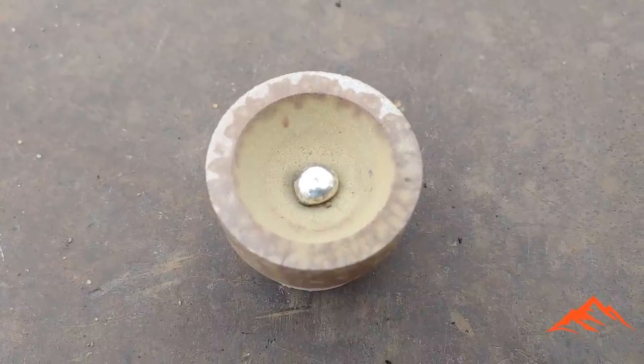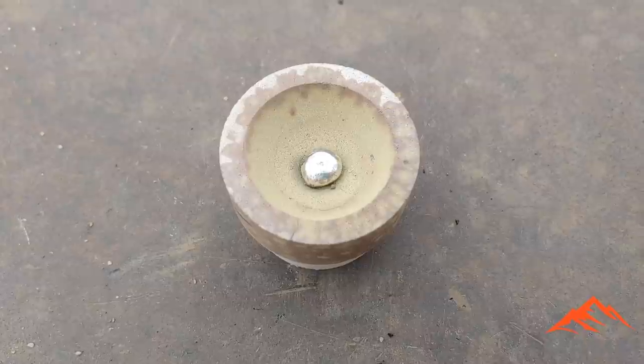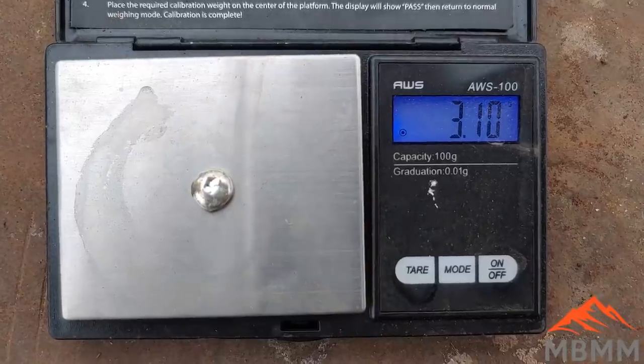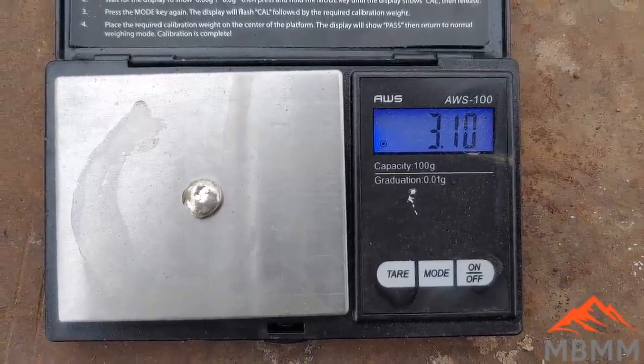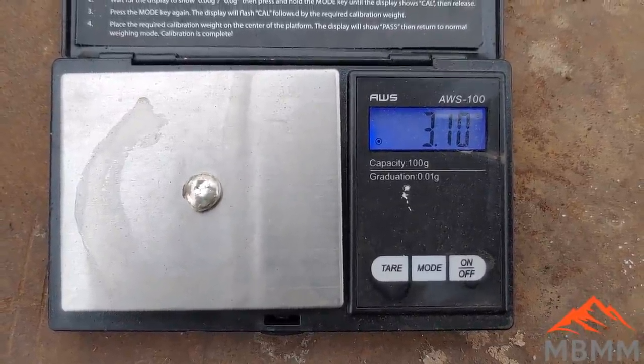And there's a little bead. We got it pulled out of the furnace. It's mostly silver now, so it's probably over half silver by weight. But we'll get it pulled out of there and get it weighed. And there we go. We got a little over 3 grams. So I wanted to show you guys that's a real good way to take a bunch of little beads and stuff that you don't want to lose and conglomerate it into one nice big precious metal button.